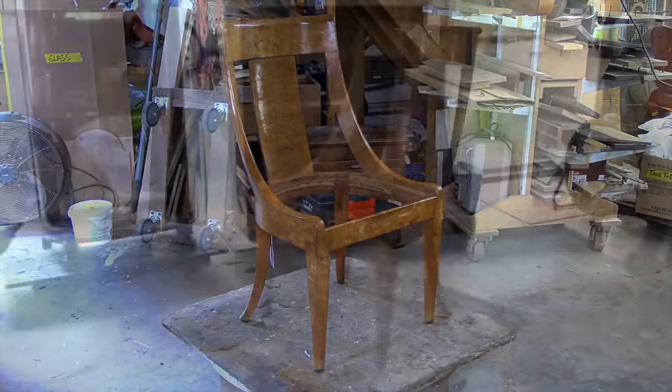The leaves are sanding up easier than the center section, which is nice. They're not nearly as bad. And in the areas where the finish is smooth, it actually sands up with a minimal amount of the clogging sandpaper. All right, now I'll give the leaves the same treatment with the wax wash remover as I did on the center section, and then I'll pad some finish on them. Okay, so now I'm gonna pat a coat on these two leaves, and then I'll do another coat on that center section. So I put the tung oil varnish in a little squeeze bottle to make this padding process easier.